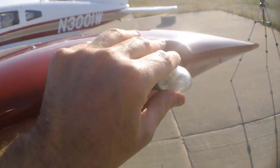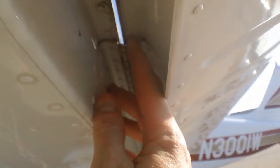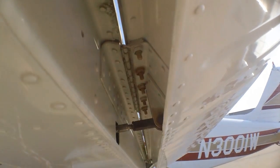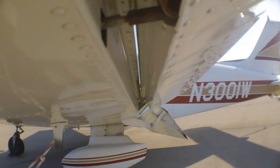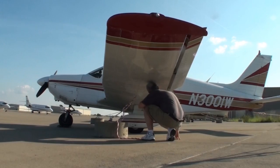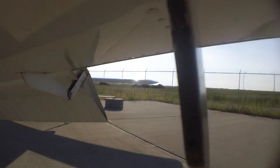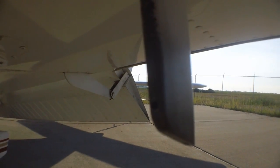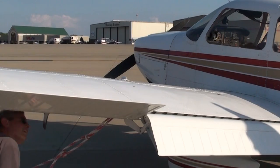Check the nav lights. We'll check each of the hinges — these don't have cotter keys on them; the pins are just bent over on the ends. Here on the rod ends for the aileron actuators, we'll check those to make sure they're free. On the Archer the pitot tube and static port are one item, so we check the pitot tube on the front end, the static port on the bottom, and the drain on the back. Those all look good.